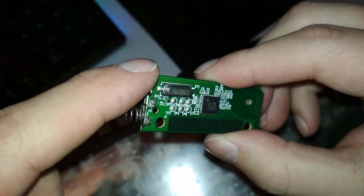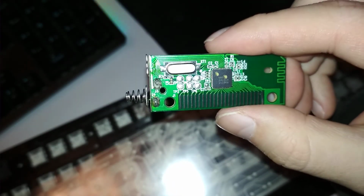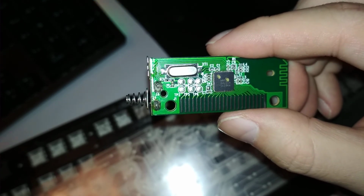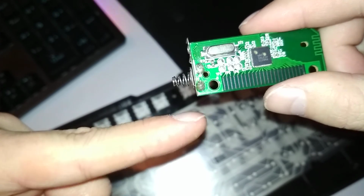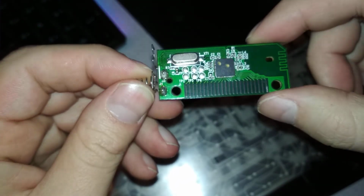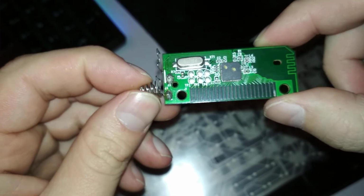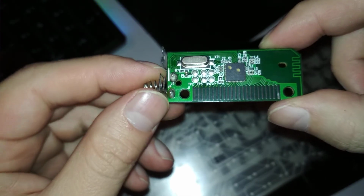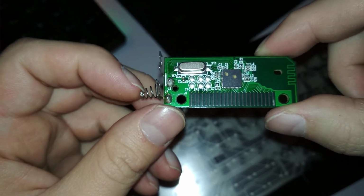So it will use 2 batteries, and if I want to connect the backlight, that will probably use 5 volts from USB. So my thought was that I'll have the 2 batteries, and for the backlight I connect another battery to have 4.5 volts, and that should be enough to power the backlight. I always use it on the darkest settings, so it should be enough. And even the USB specs are tolerant. They can go down to 4.5, no problem. So it should be enough.